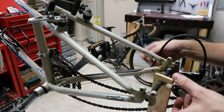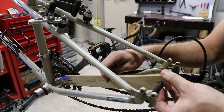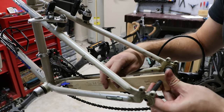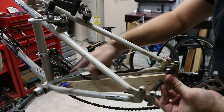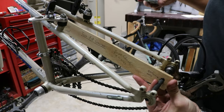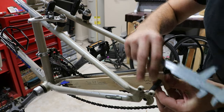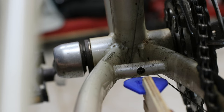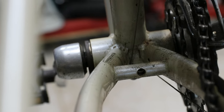As a sanity check, I got the tool on the back. I couldn't do the front because the wheel I was going to use is a through axle. On the back, I'm on the 29er 700c slot and using the 34 millimeter insert. It looks like — maybe I should measure it. The main clearance concern, if you want to call it that, is in that direction. It's about the same for both the seat stay and the chain stay bridge. It looks like it has enough clearance. The gauge says this is a 34 millimeter tire, and my actual tire is a 35. I can see about 10 millimeters — about one centimeter — of clearance.